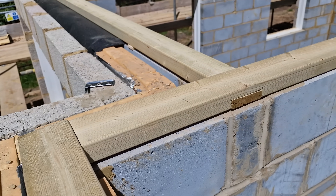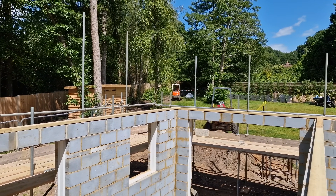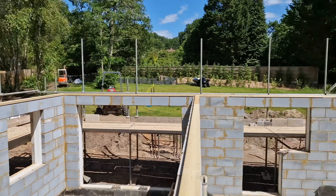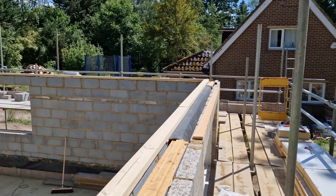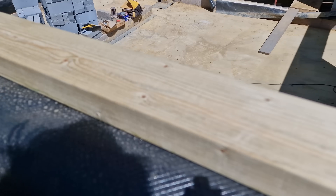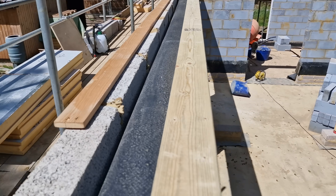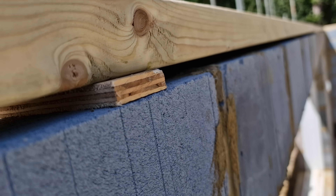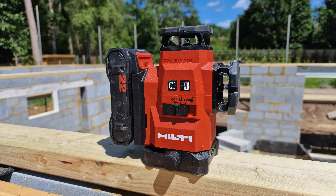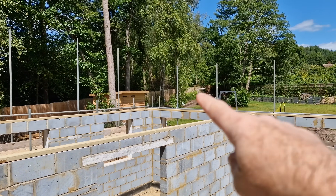Typical lap joint — we're ready to go. That corner I'm looking at is what we call the high spot, a little bit on the high side, and we'll start there with about a 12 to 15 mil bed. When we get down to the other corner, we'll end up with a 15 to 20 mil bed — three quarters of an inch or thereabouts. This is quite important because our lintels stick up a little bit where the block work runs inside them, so we do need to be up a bit. We've got the laser set up to enable spot checks and get the corners right.